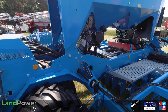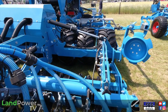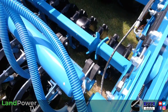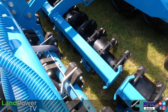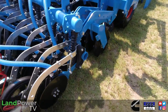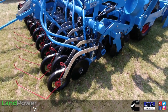The tyre packer in the middle is pretty self-explanatory — staggered, each wheel covers three coulters on the 167 spacing and four on the 125 spacing. Then we have the little trapeze packer roller in the middle as an option — a very Lemken thing. The trapeze packer roller is what makes the disc coulter work, whether it's on a combi drill with a power harrow or a trail machine. A lot of our competitors don't offer a roller in here, but if Mr. Farmer doesn't want it, we take it out.